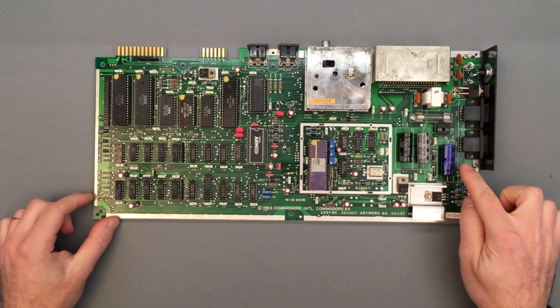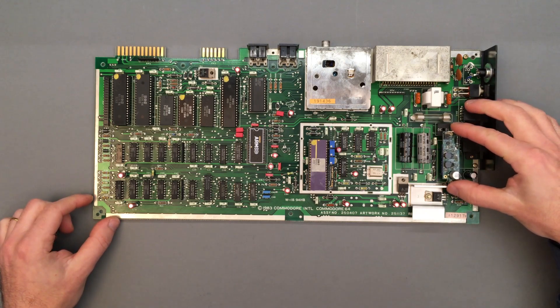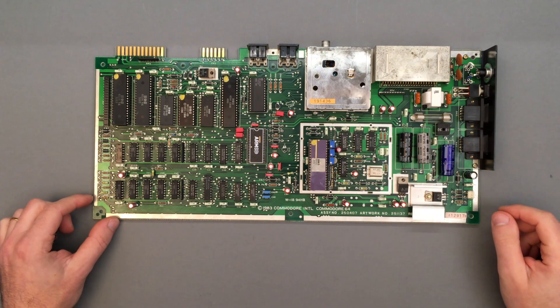This is what the original circuit looks like. The new power board will simply replace C19 without the need to remove any other component from the motherboard, though I will remove C90 as it is part of a charge pump that becomes completely inactive thanks to this mod, so I didn't bother putting it back.